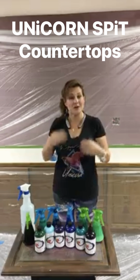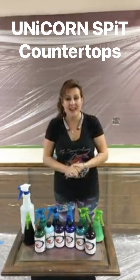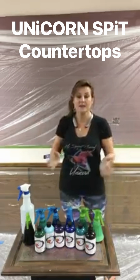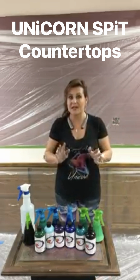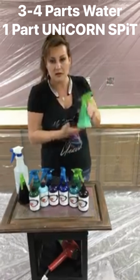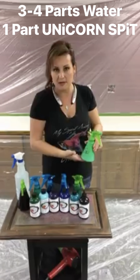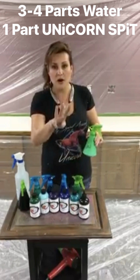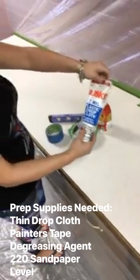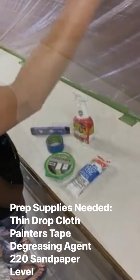Here to present you UNiCORN SPiT and how to take average laminate countertops and turn them into what looks like polished stone. We have all of our colors here placed into dollar store spray bottles, diluted 3 parts water to 1 part UNiCORN SPiT.